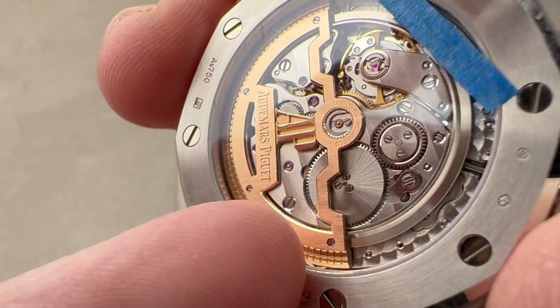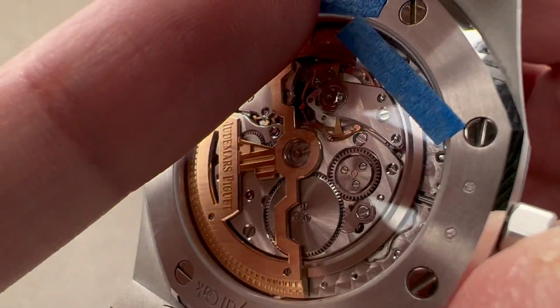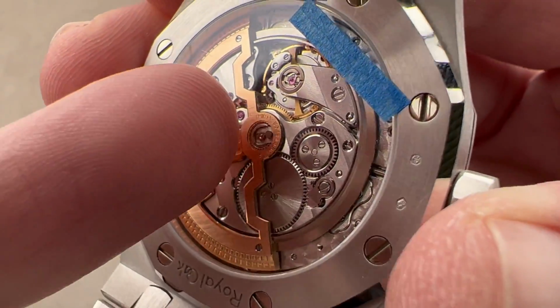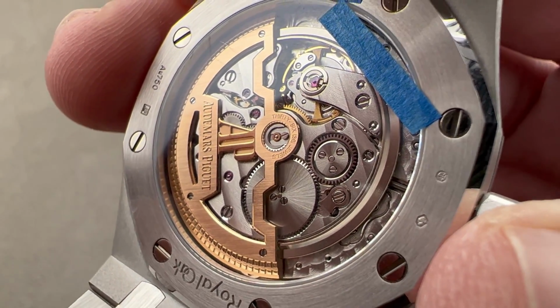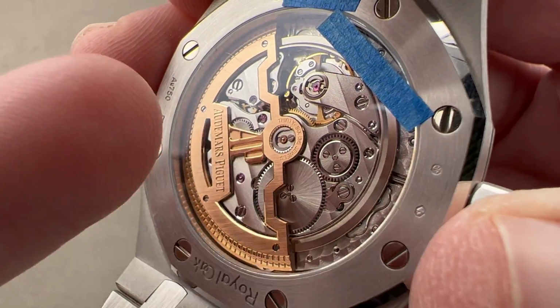So the mass sits on one side of the ring. The ring goes all the way around the movement. There are 4 ruby roller bearings at the corners that allow the ring and the mass to be sunken really close to the bridges and plates without contacting them. That's how the base movement manages to be just 2.45 millimeters thick. That was part of JLC's ploy back in the late 60s to create the thinnest automatic movement that could be made reliable and accurate.